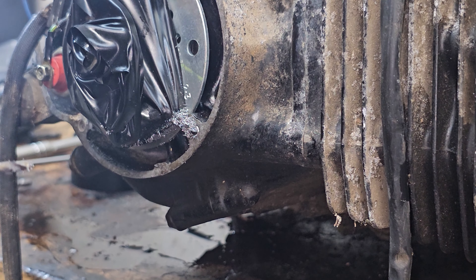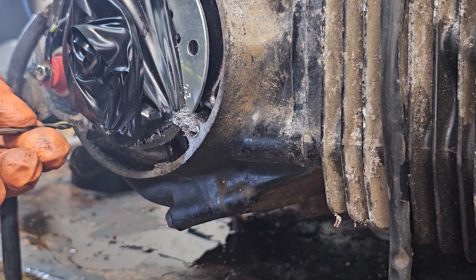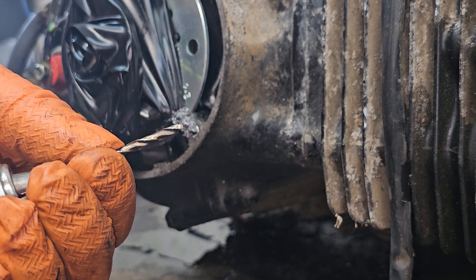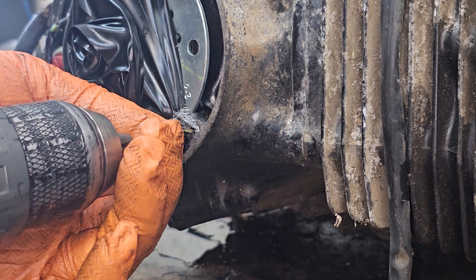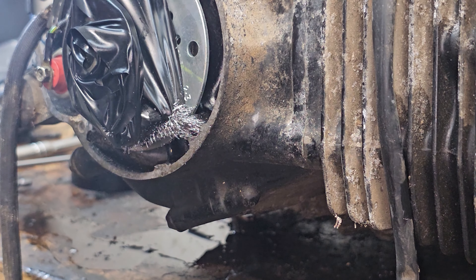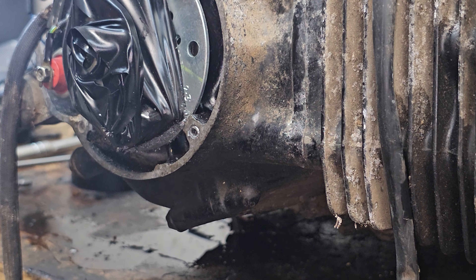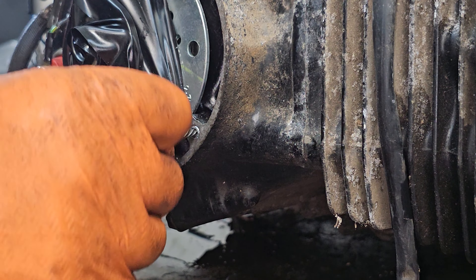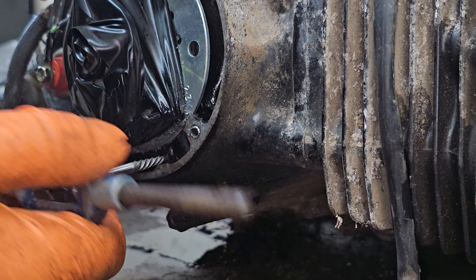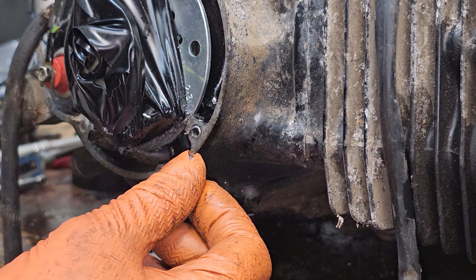You guys said you wanted to see this, so here's proof of me getting this bolt out. Let's see how deep we need to go — popping it into this hole, clean the drill bit up, drop it in. So that is the length of the bolt. Still a fair way to go yet. That seems like it's gone all the way through. I don't have my smallest easy out — that should be just about small enough. That does not feel good. There's no torque on that; it should just roll out. It might be oxidized on the edges — when steel meets aluminium, you get horrible corrosion.